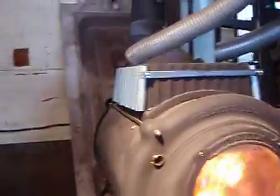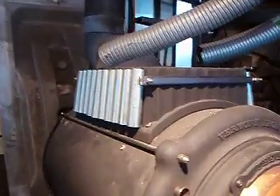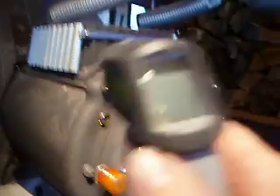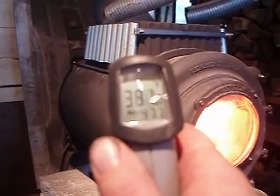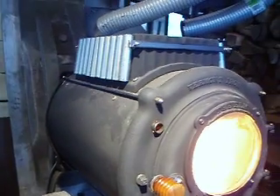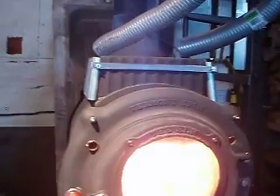Another set of tubes — this stove is all about tubes these days. The barrel of the stove is essentially a large tube. There's a network of tubes like an organ on the side here, which are open on the top and the bottom. And when I take this little heat gun, I can show you that the temperature at the top of the tube is 164. Temperature at the bottom is in the upper 400s. So what they do is they suck in cooler air at the bottom, and it exits out the top much warmer and circulates air throughout the room.